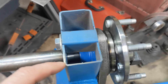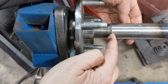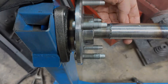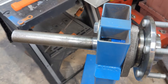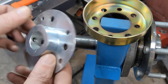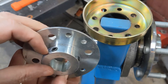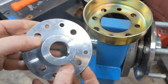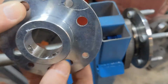That looks like it might be just about right. It's just the big part of the shaft that I expanded is running into here — basically this wider part is hitting where the hole is. So I'm going to take about an inch off here and bring it back down to size. Miracles never cease. So this is the brake drum that's got to go on here — obviously it flops around. This is the adapter plate that came with it; it's for a one inch shaft. This is a one and a half, so it obviously won't go on there, but it's got quite a bit of meat here and two set screws to hold it in. So I'm going to put this into the lathe and bore it out so it fits on here. I just turned that down basically till the keyway was gone.